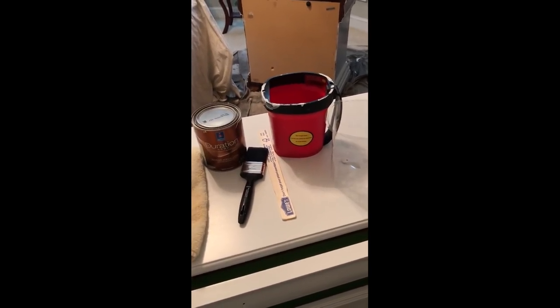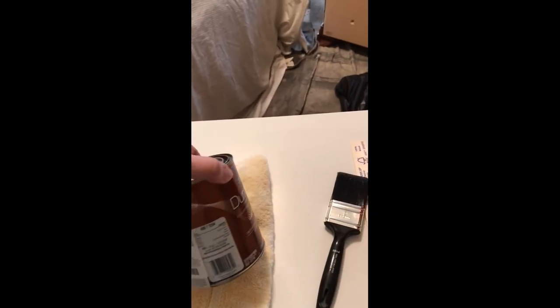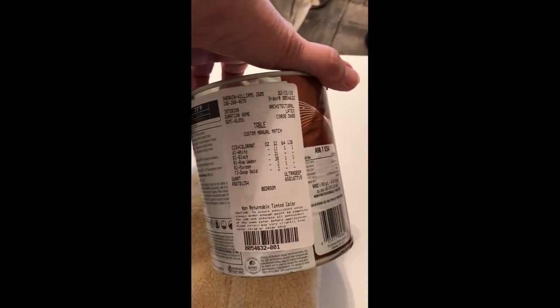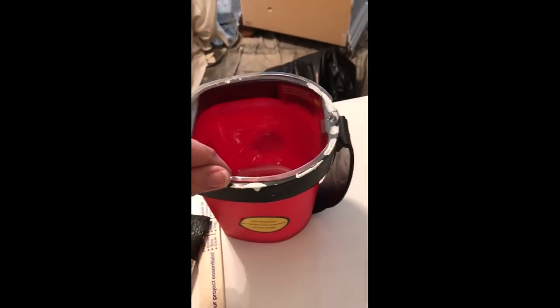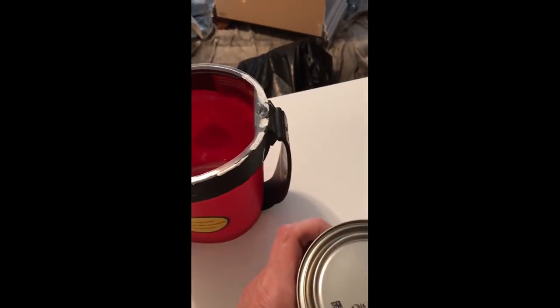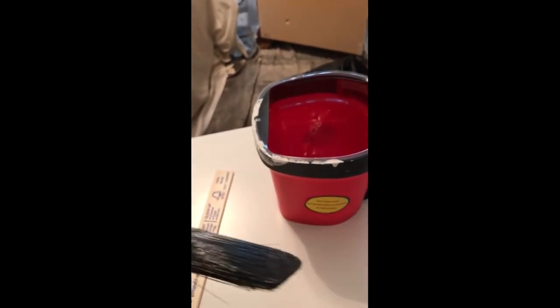Now that I'm going to apply the gray wash to the painted pieces, let me recap how I'm going to do that. This is a custom mix — a beautiful gray color — similar to the anodized bronze Rust-Oleum spray paint formula. I'm going to mix it with water using this little cup that you can buy plastic liners for. I'll pour some paint in, add some water, and mix it up really well. I've got an inexpensive brush that I'll apply it with, and then wipe it with a rag as I go.